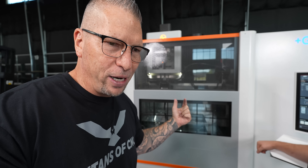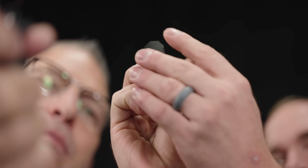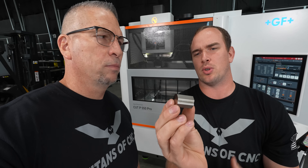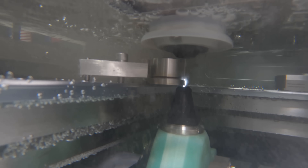Trevor's already been making crazy cuts. We made this little test cut right here — it's got some crazy little V grooves in it. Beautiful. It's about an hour and 15 minutes — a rough and four trims on this right here. It came out about 7.6 RA on the surface finish. Just perfect. Very accurate, better than an 8 RA on the first try.